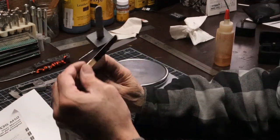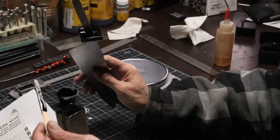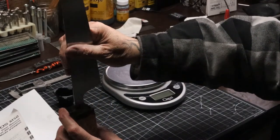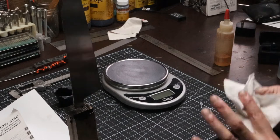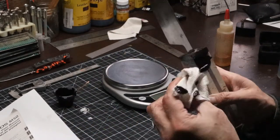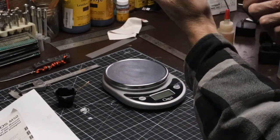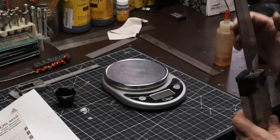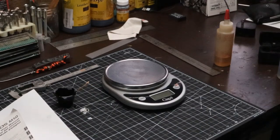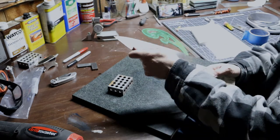Typically when I bed tangs, I usually use G-Flex epoxy, which gives you about a 20-25 minute working time. And it sets up a little bit slower. 5 minutes tends to set up too quickly when you're bedding tangs. So I like to have a little bit more of a time frame where I can have the tang sitting there, have it cure up just about to where it's still pliable, and then pull the tang out.